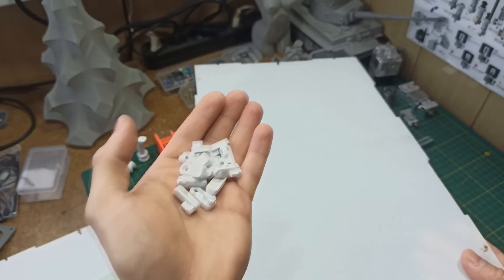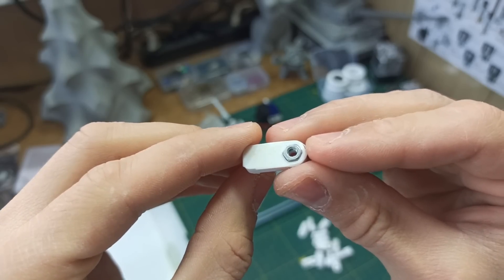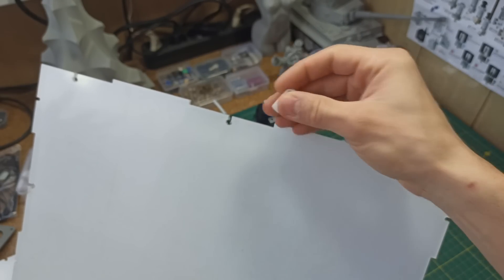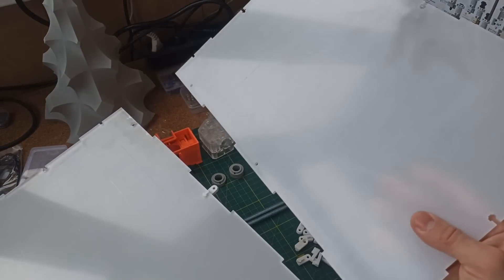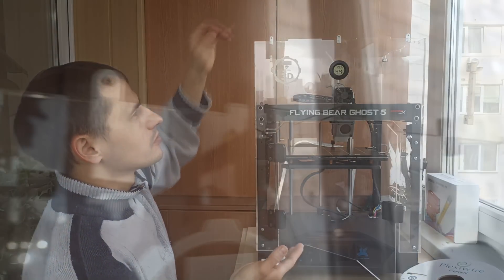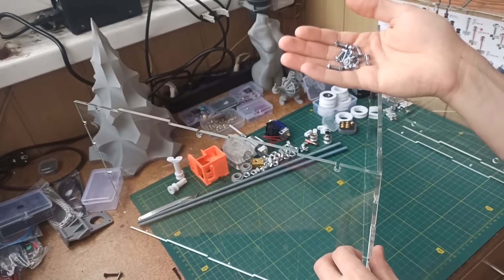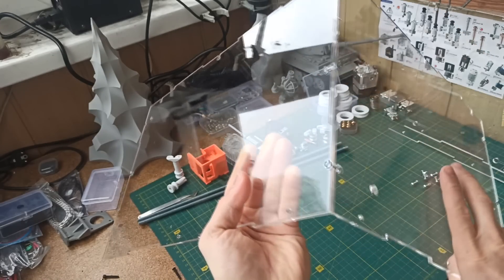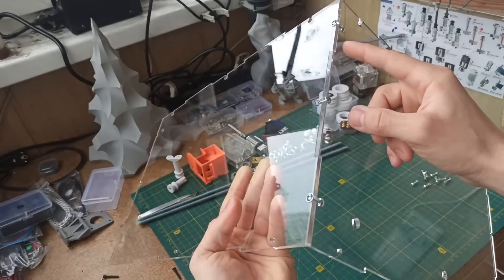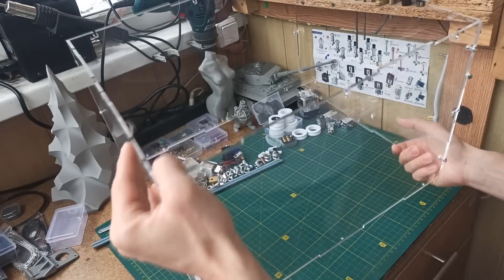To connect the panel to the thermal chamber, we use specially designed mounts. This is how they look. We press-fit an M3 nut here — like this. And on the back side we have a cross-shaped slot. Our thermal chamber on the printer has slots with cutouts into which we insert our mounts. Our mini-box panel will connect to the main body this way — all our slots are installed from the inside. So, friends, we have placed our mounts around the perimeter of the thermal chamber. Now we'll assemble our additional compartment — same type of mount: M3 nut and M3x10 screw. One corner is already done. The construction turned out quite rigid and reliable, with fixation in two directions with two screws and one direction with one screw. More than sufficient. And we get quite a rigid acrylic frame.